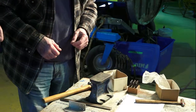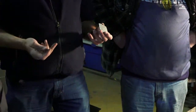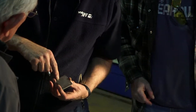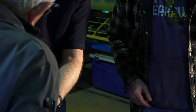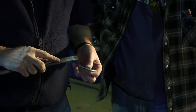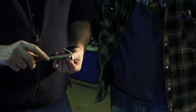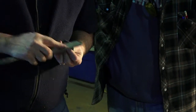When you drill a hole, we talked about stress risers — and you can actually see the stress risers on here if you get looking. Every piece of skin you're going to work on, you're going to do this as well. You're going to do probably three passes at least with a file on each edge.